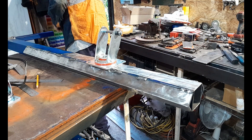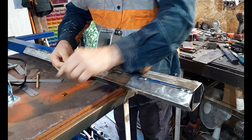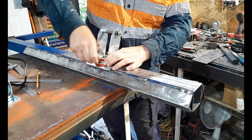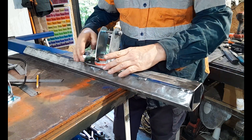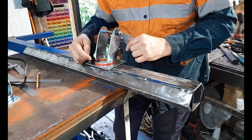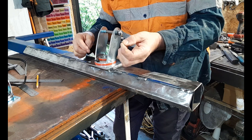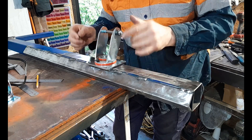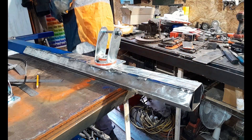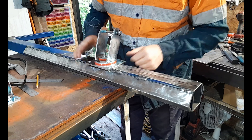You could put a little tire valve cap or tube cap over the grease nipple. It's going to get a bit hot but it will protect the grease nipple from anything splattering and getting stuck on the ball. If you don't do this, a piece of weld slag will end up right on that ball — put something on that to protect it and save yourself coming up with new curse words.